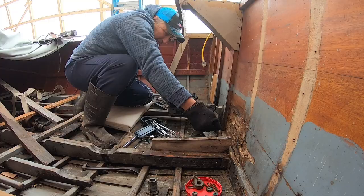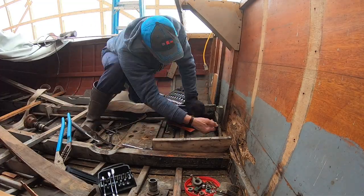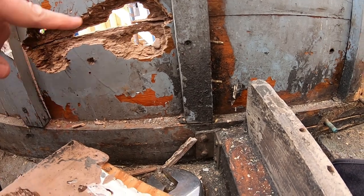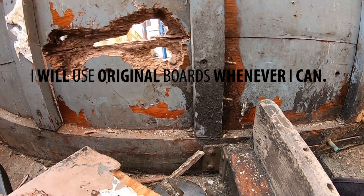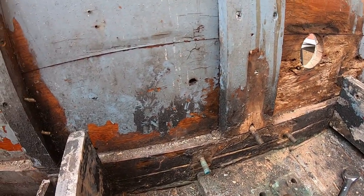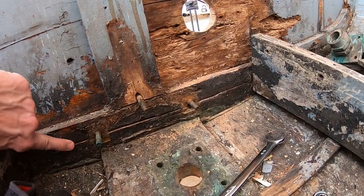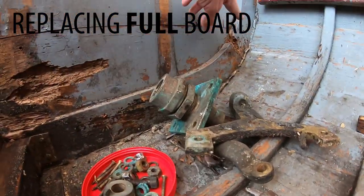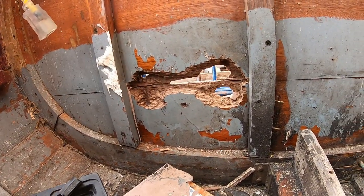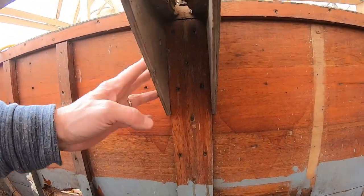I took this opportunity to get some of the mechanicals out of the way to make this whole area easier to work on. Now we can see what this piece of plywood was hiding — some pretty serious rot, mostly on the bottom board. We can Dutchman in this little section right here. Most of the rot seems to be confined below this line, so we will replace this bottom board in the transom, which is going to be painted because it's underneath the waterline. This section is cracked, so we're going to replace this board, at least a section of that one, and the bottom of this one over here. And more Bondo — boy, this guy loved Bondo. We're also going to replace these two inner corner pieces right here, so we'll get this whole thing done at once.